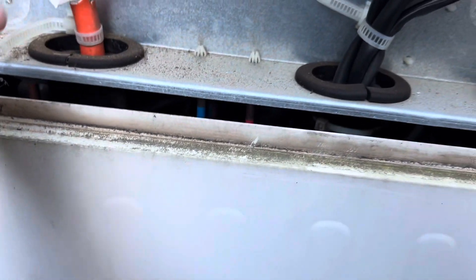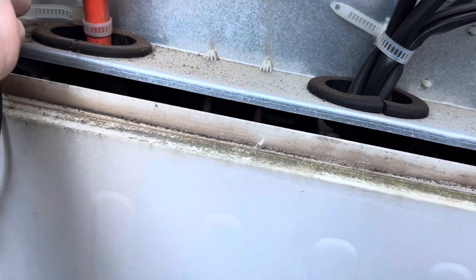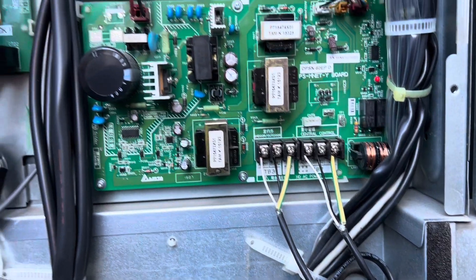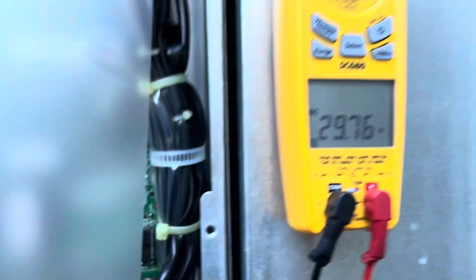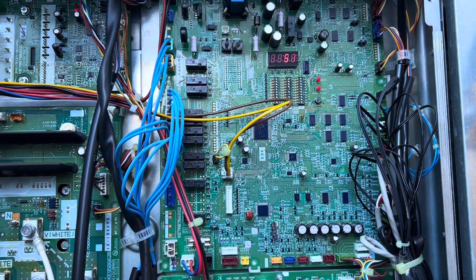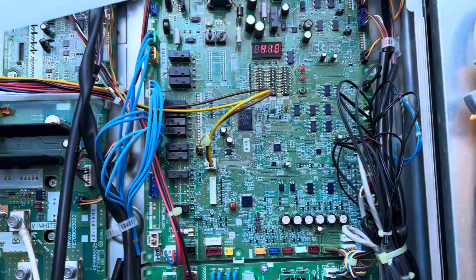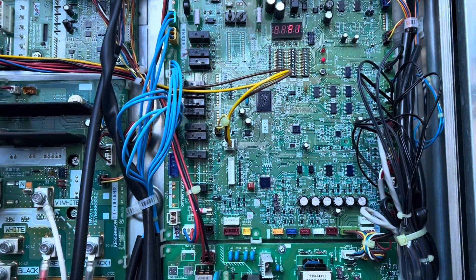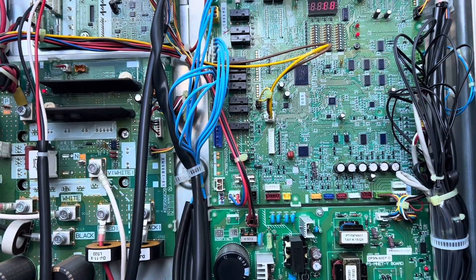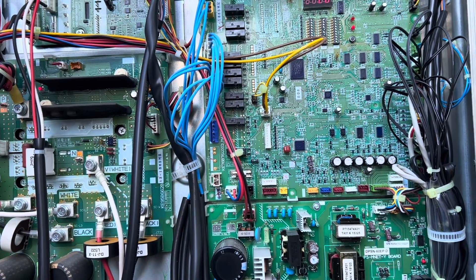You can hear the LEVs. We've definitely got power — that's good. We'll let this thing load up and we'll test our comms voltage. Awesome — our outdoor board is sending the correct 29 volts. The board's just powering up now. I haven't reset power to anything else yet. We'll go in and check the thermostats and see if they're still in error.